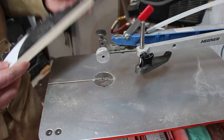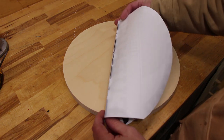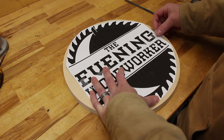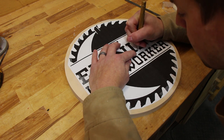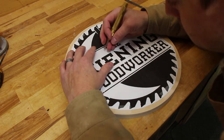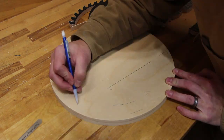A few hours later I had each of the individual pieces cut out and was ready to glue them to the board. However, I had to get them located perfectly. So I printed out another copy of the logo, taped the two halves together, and then taped that in place on the circle. Then I used my center punch — although you could use any pointed blunt tool — to press through the paper to mark the corners and locations of each of the pieces and letters. Once they were pressed through, I outlined them with a pencil.